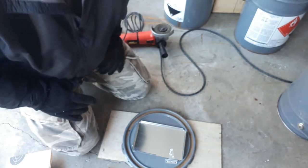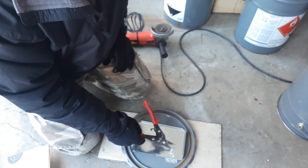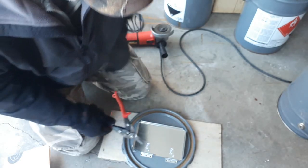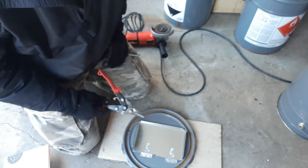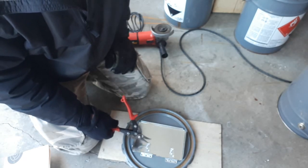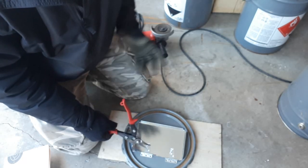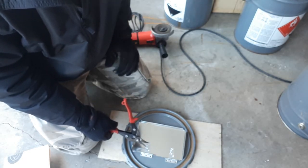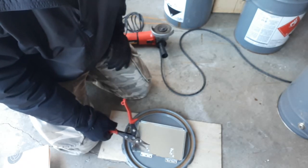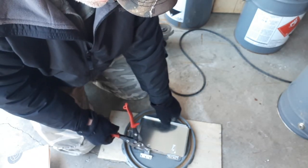And the hinges that I bought in this case have a little longer lip or mounting surface on this one side. And the reason that I chose to do that is so that once I drill my holes here and mount it with my hardware, and I think in this case I'm just going to use pop rivets again, but you could use screws, that would be fine. But using these two outer holes, that's going to keep the hardware away from this inner edge here.